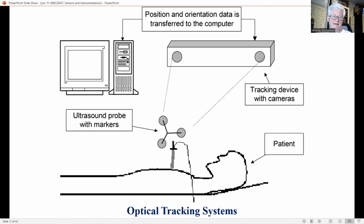Tracking systems using a special light source can be configured in various ways, depending on such system classifications as power consumption, available space, and environmental conditions. Since the transmitter usually takes most of the available power, the choice between putting the transmitter or the receiver on the moving object is an important one.